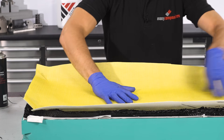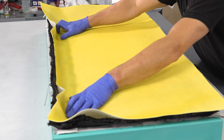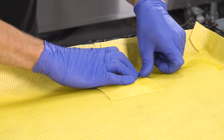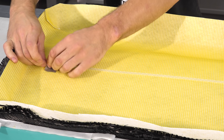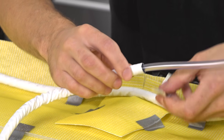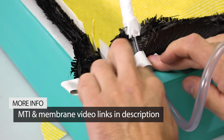Just like working with conventional peel ply and mesh, it is really important that this covers all areas of your moulding. You can have overlaps in this material with no problem, but you want to ensure that you don't have any gaps. It will follow moderate compound curves reasonably well, but if you have sharp or intricate areas you might need to put a few cuts into it to allow it to conform more easily. The resin connector and feed spiral can then be attached. As this is a mould with a thick laminate, print through from these will be unlikely, but acceptable if it does occur, allowing me to position them in the centre. For the vacuum connections I'm going to use MTI hose — a line with a breathable but resin-proof membrane. If you want further information on MTI and other membrane products, we have a video covering this specifically, linked in the description.